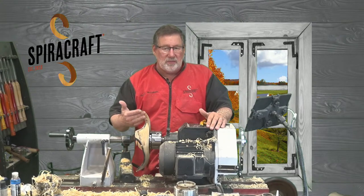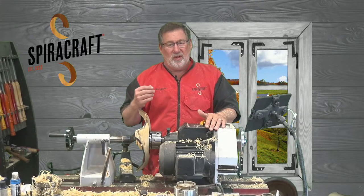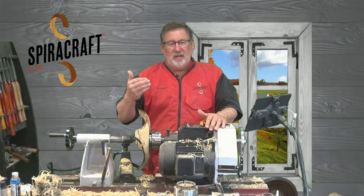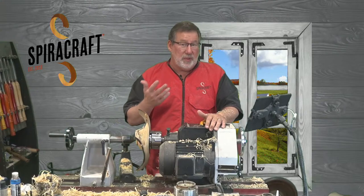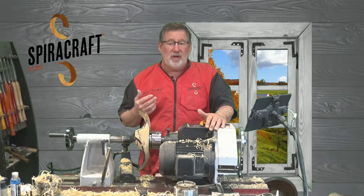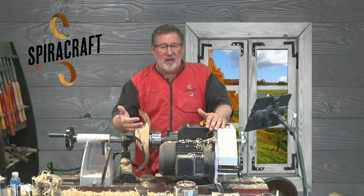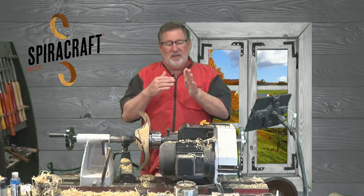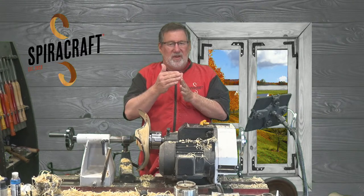So a lot of that part is psychological, but there is also, I have to say, some tool control there, because that tool is cutting and missing and cutting and missing and cutting and missing. That's why I dialed the speed up to, in this case, about 1200, and I started to vibrate. The faster it can spin when you're cutting and missing, the easier it's going to be for the tool to not wander in that free zone.